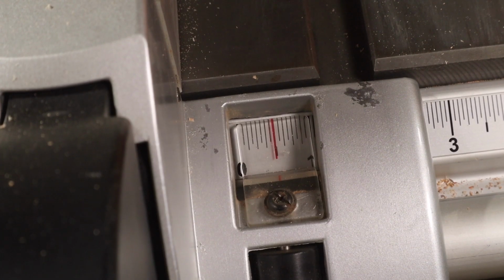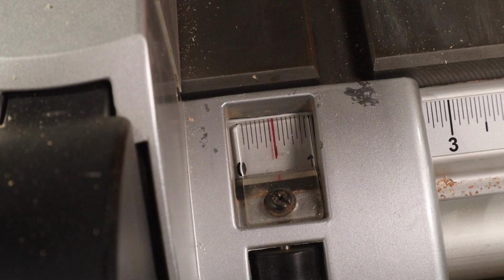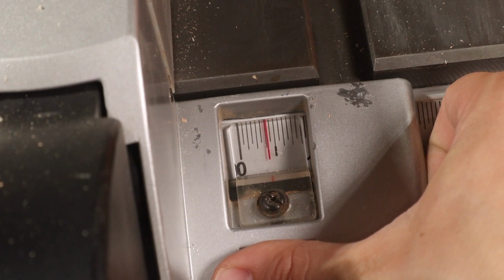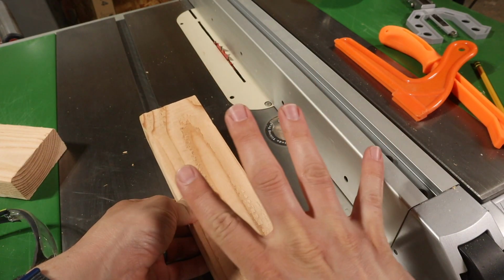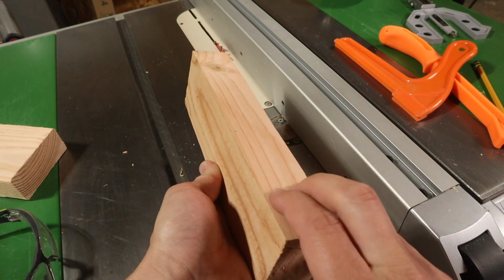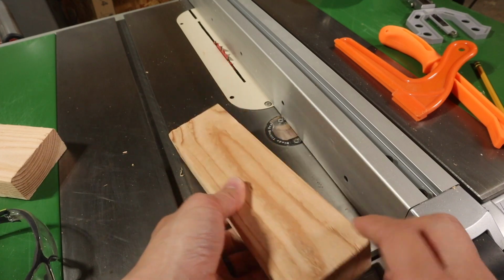So there's two parts to the tongue and groove. For the tongue, you're going to want to move it 1 blade thickness shorter than your 1/2 inch. And so in my case, I've got 1/8 of an inch. And so I'm going to move it 1/8 of an inch that direction. Next up, we have 4 separate cuts that we're going to be making. 1 on this side, 1 on this side, and then 2 on this face right here. This is where our tongue is going to be.